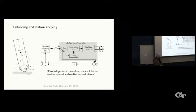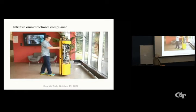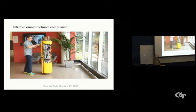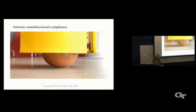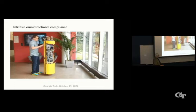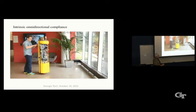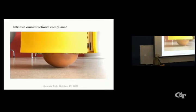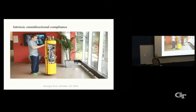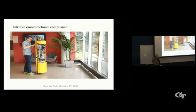So this is showing the ballbot just balancing with the balancing controllers running. And Mike is pushing it around. So even though the inverse mouse ball drive has a ton of friction in it, that all goes away because of the control. It's a so-called admittance system that takes all that friction out because of the control. So that gives you a feeling for it, and at this point, the robot weighed 65 kilograms, and I think it weighs a lot more now.